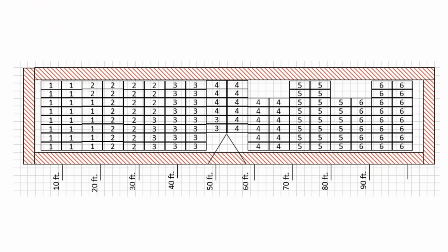I mean, it's always going to be more cost effective to fill up your circuits with as many modules as possible. But if it's a difference between doing 5 circuits of 15 modules, or 6 circuits of, I don't know, I'm just guessing, 12 modules or something like that, then I would go with the extra circuit, pay a little bit more in material costs, but have a much more serviceable solar array.